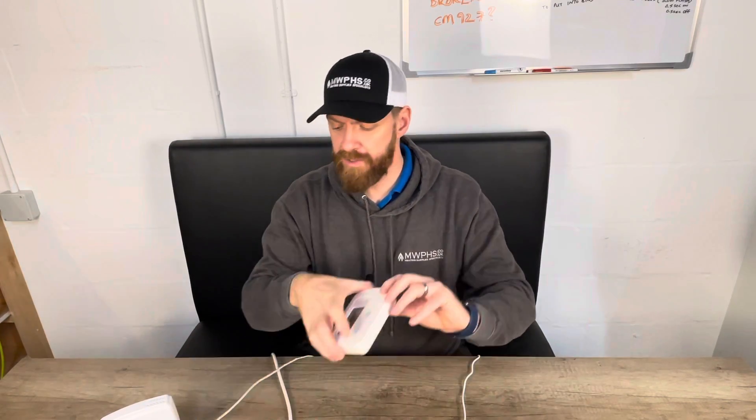So to recap the three options: first is the Pro Series thermostat — your first upgrade option if your CMS927, CM921, or similar is broken and you have an existing BDR91. Second is the T87RF and RFG100 upgrade pack. Third is the EVOHOME system. The EVOHOME option works for both gas and oil boilers, while the Pro Series and T87RF are for gas boilers only. If you have an oil boiler with a CMS927, upgrade with EVOHOME.